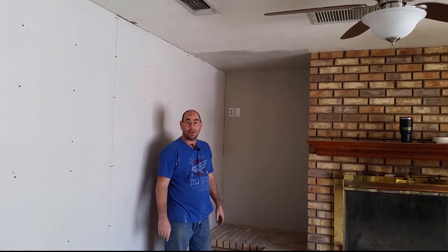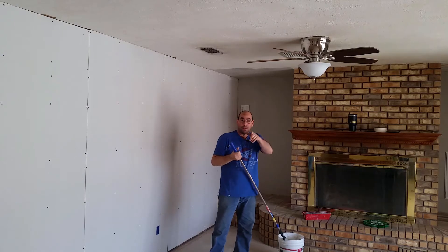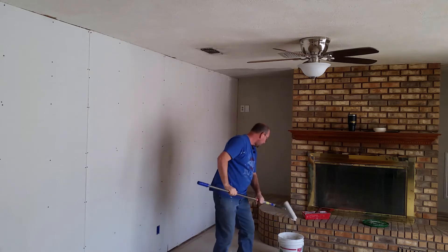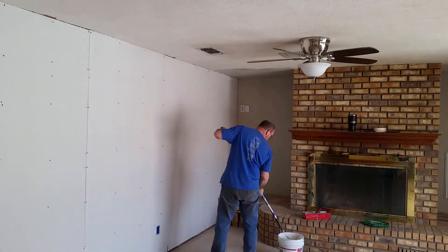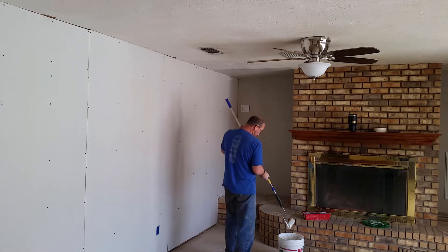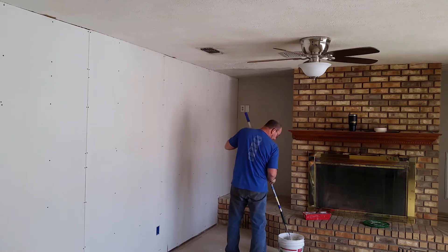So what we've chosen to do is roll the texture on and then smooth it out. You're gonna have lines your first time and you're gonna want to sand it. This is not for the faint of heart — it's kind of labor-intensive, but it is cost effective. So if you're like me and there's several inches of snow outside, or you're just cheap, we can get it done like this. We're just gonna load up a bunch of texture on the roller. This is messy, I'm just gonna tell you. Don't roll fast because the faster you roll the more you sling off.